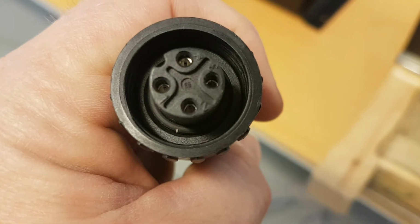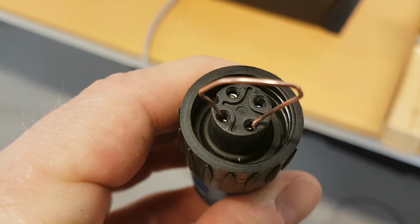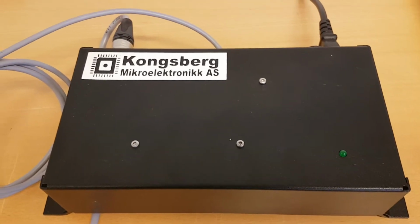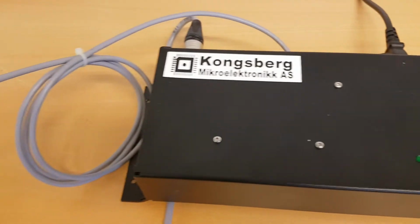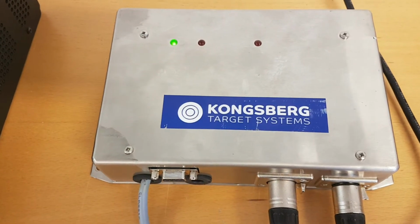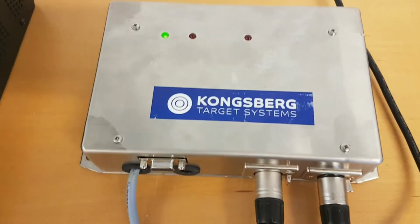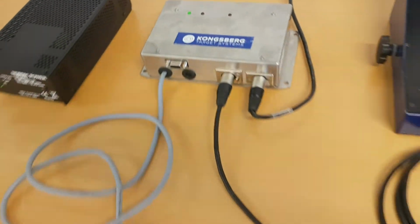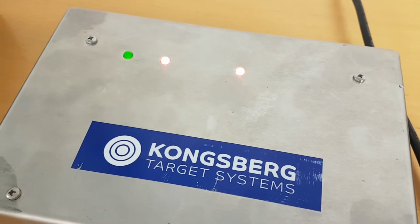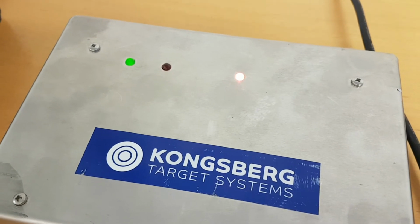We just introduce a new part of the chain. So we have connected 1 and 2. The power status of the power supply is not relevant for the targets. The signals are just going straight through in any case, so it's on or off, doesn't matter. But now we have the short circuit to the cable normally attached to the target server, and we see that the current loop is complete. But again, we need to verify, so we remove the connection, and this should result in a light in the LED because the current loop is no longer complete, and that makes sense in this case.